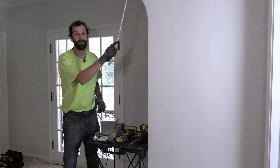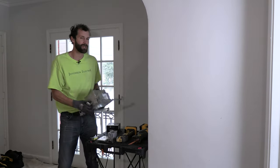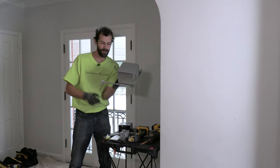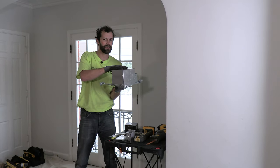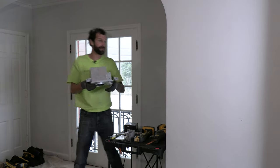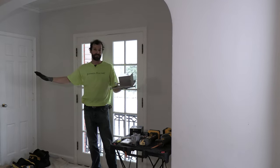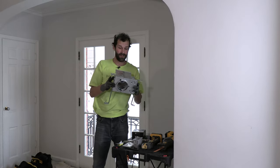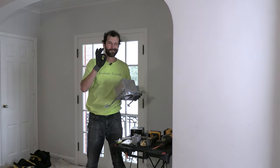Off of this switch, I'm going to go up into my attic. I do have a floored walk-up attic that's going to make it easy to get up there, but could provide some obstacles for wiring. Then I'm going to come into a four-inch New Work can light, designed to be nailed into the framing space. I chose a four-inch because I'm putting the light in a relatively tight space and I don't need to flood it out.